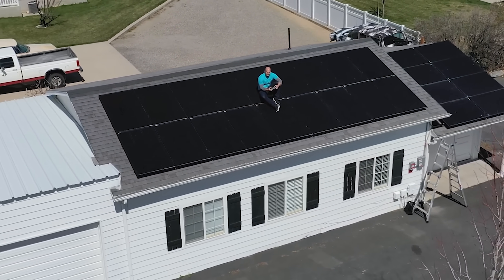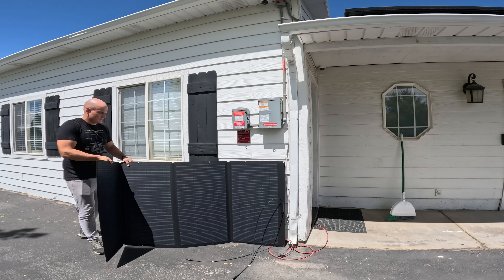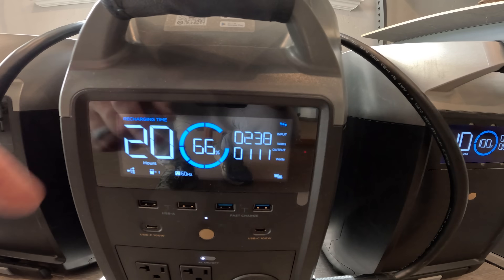You might have noticed that I have solar panels on my roof — it's a grid-tied system with micro inverters. While these will power the building while the sun is out and connected to the grid, once the grid turns off, my solar panels will not recharge this setup. Unless I get up on my roof, disconnect the micro inverters, and run the solar panels through a DC connection in the back. These units can each take up to 1,600 watts worth of solar, and since they have internal inverters of their own, I'd have to disassemble my grid-tied solar and wire it up as an off-grid setup. Very doable in an apocalyptic situation, but not something I can change easily back and forth. So for now I'll stick to portable solar panels, and maybe someday I'll do a dedicated array just for an off-grid situation.